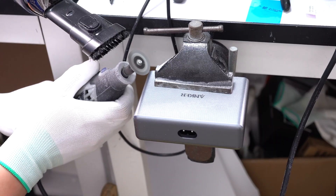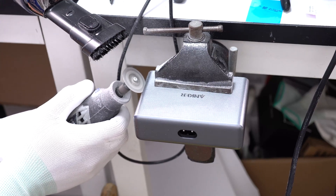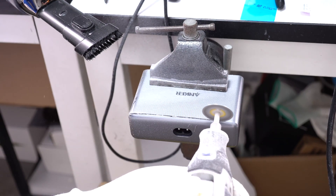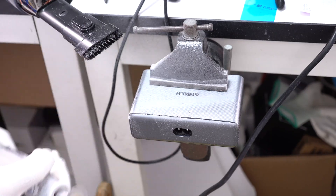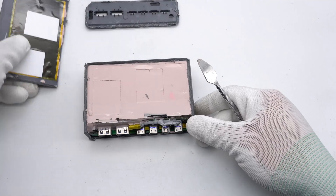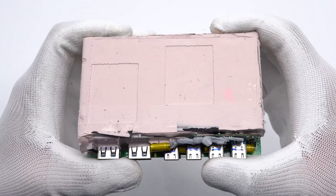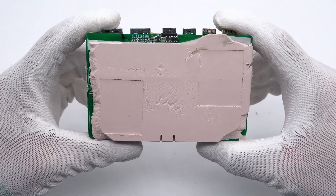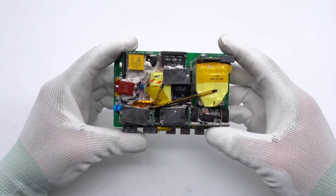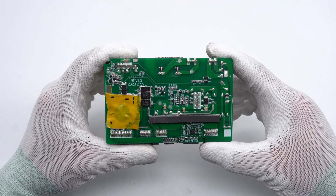Using a cutting machine to open the case, we remove the PCBA module. The entire PCBA module is wrapped with potting compound to improve heat dissipation. After cleaning up the compound, we can see the input socket, filter capacitor, and buck PCB are insulated with Mylar sheets, and components are fixed with white glue. The back of the PCBA module is slotted for isolation with a Mylar sheet inserted for insulation.